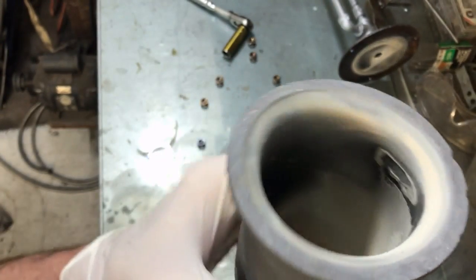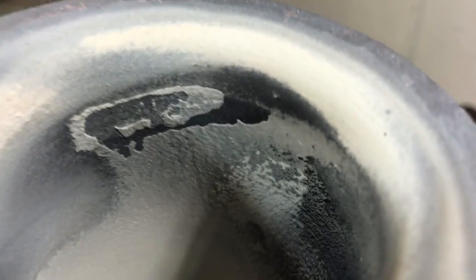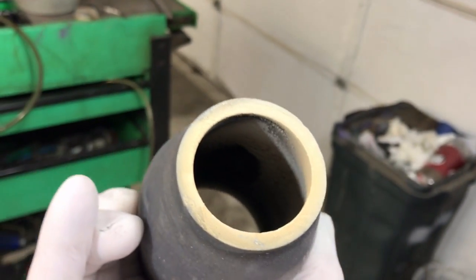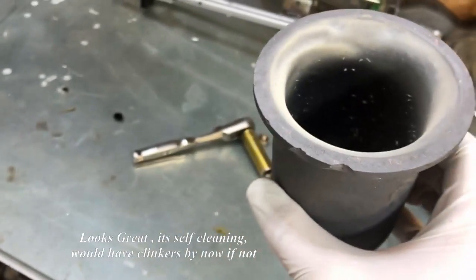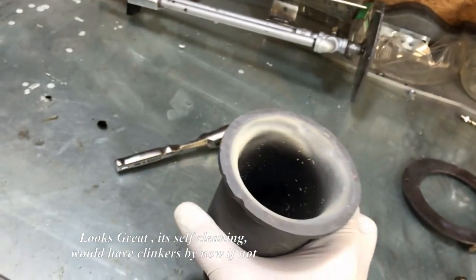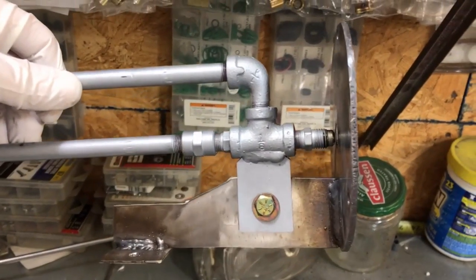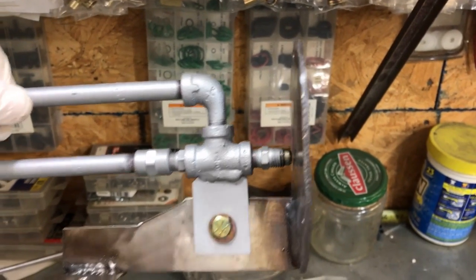Let's see if I can get a flashlight on this thing. There's a white ash sheen to it — very weird color. I've never seen that color of build-up before. It's yellow. That is so odd. There is a little bit of black build-up in there. I think my nozzle was out of alignment just a little bit. If you look at the angle of the nozzle there, you can see how it's tilted a little funny in relation to the plate.